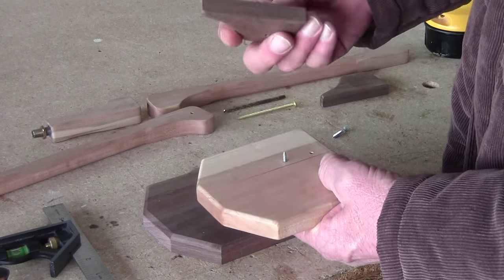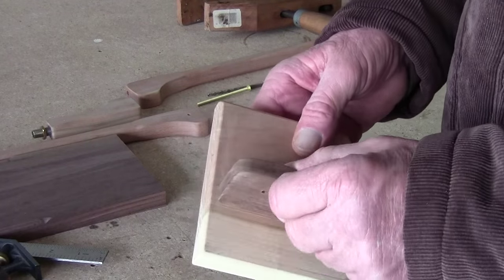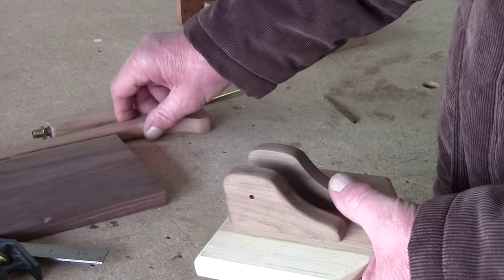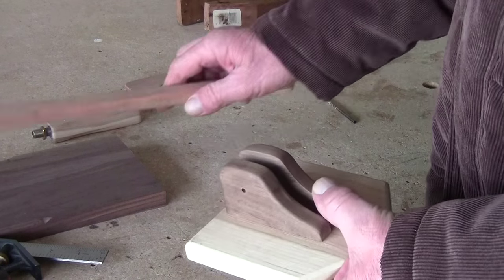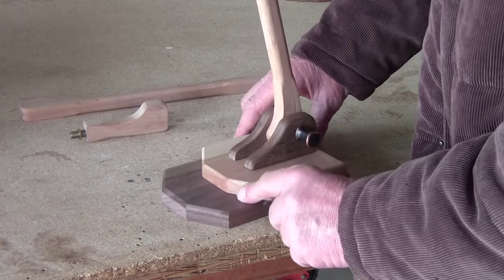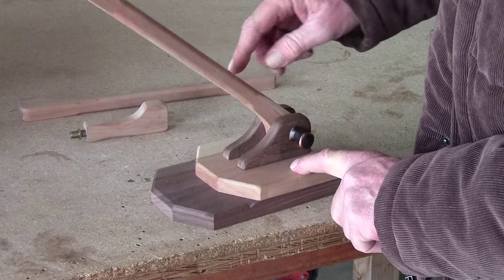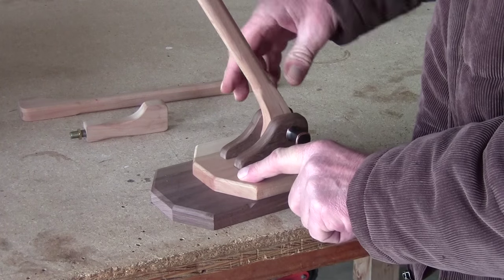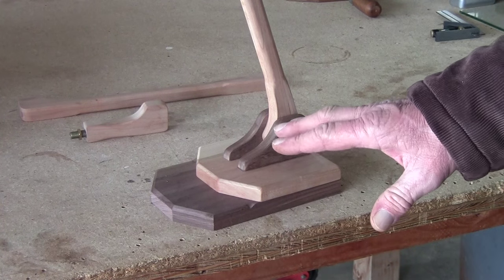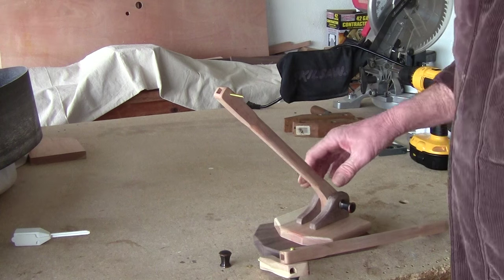I got the other screw in — it's really solid — but we're not gluing this yet because we've got to get the other side lined up. Do the same to this side: get it lined up with the piece in the middle, drill, and go for it. Now it's complete. The screws are countersunk so nothing protrudes. Once it's snugged down we have a nice tight fit. Next I'll sand everything down with a 400 — they're just screwed on for now; we'll glue a little later.